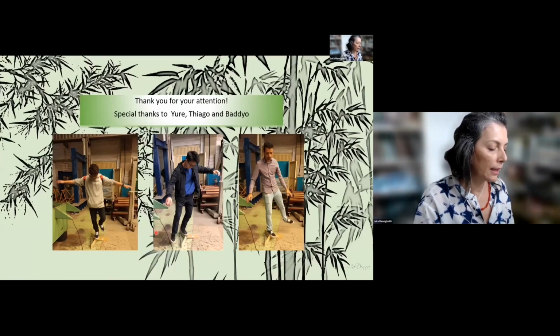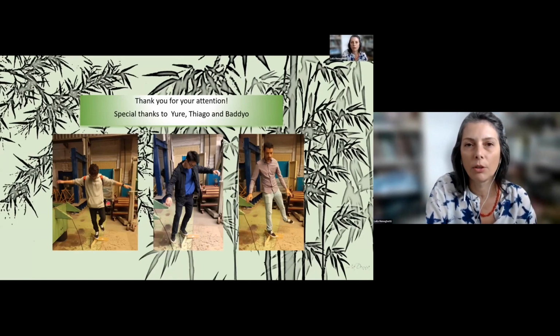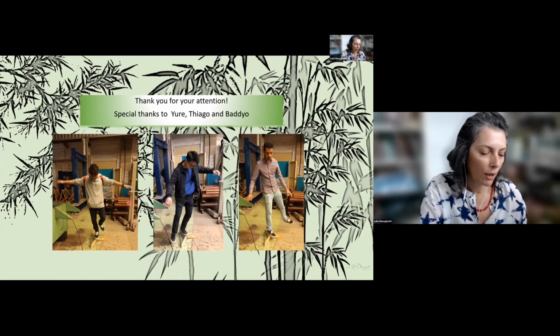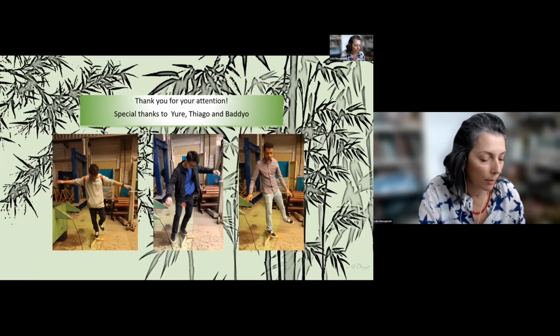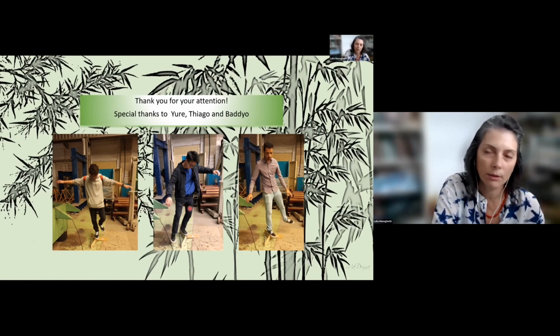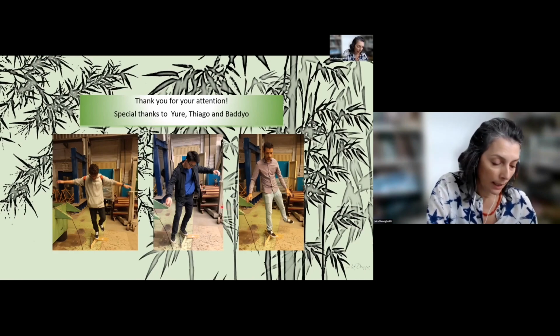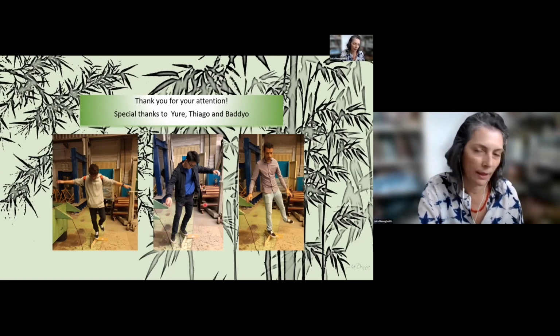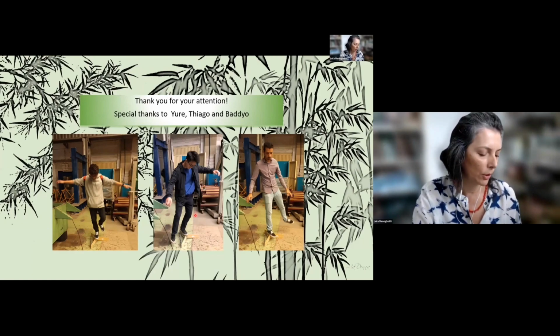To conclude, with this initial experiment we could see the potential of the structural application of engineering bamboo for grid shells. Of course, now we can better design experiments and projects using engineering bamboo especially produced for this application, and use steel plate joints designed to better perform the connection. We have good expectations to collaborate with colleagues and with the Bambuild startup, which can provide engineering bamboo for our project.